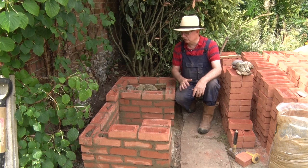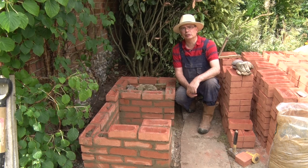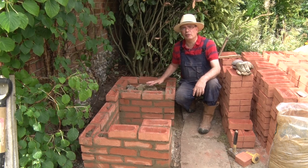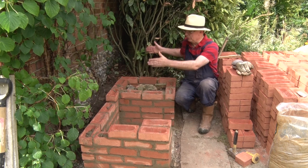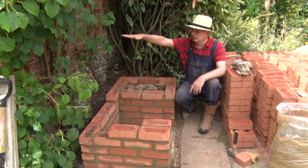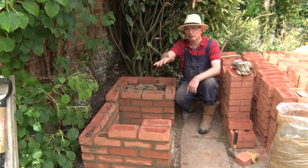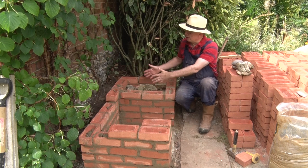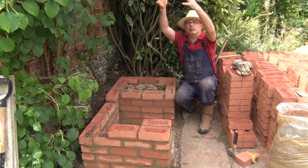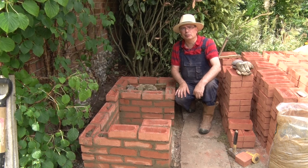What happens now is I'm going to fill this hole in here with some cement and ballast and make this into a flat top, and this will be the bed of the fire. We'll then build this bit up and the sides up a bit more, and then about here we'll put in a concrete plinth and that will be the base of the oven. The heat from the fire comes up here, through a hole in the side, through the oven and then up the chimney on the other side. It'll all make sense once you see how it's built.